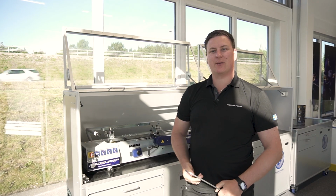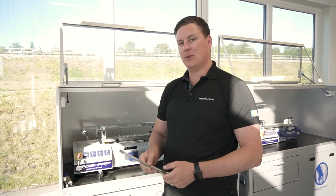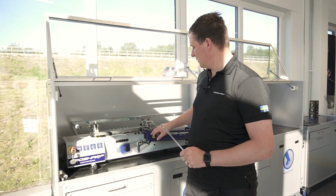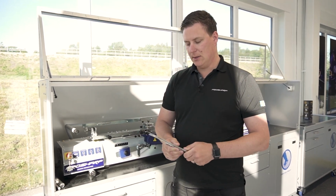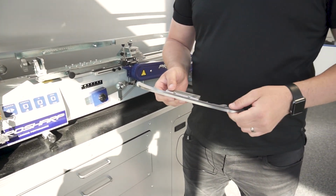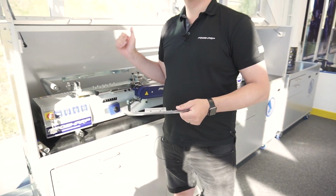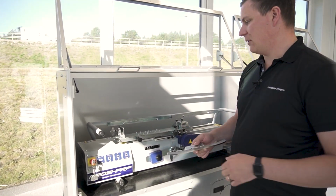And as you saw on the previous slides when we talked about profiling, the most important part when you do a double profile is that you first even them out to make sure they're 100% even. Remember to first dress the wheel on flat, use the twin blade holder to get the same height, set the marks on the center mark and where you want to do the profiling, and then mark the blade underneath with a marker. Then just sharpen the skate on flat until you have removed the marker underneath, then they're even. Then you do the profiling.